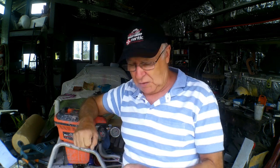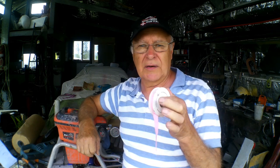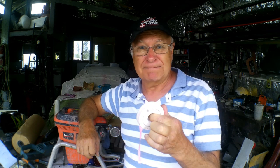The one thing you don't want with an airless spray gun is a leak, with paint spurting out at high pressure all over the place. Ask me how I know this. To avoid that, start with just clean water instead of paint, and that way you can see if there's any joints that need further tightening, or you can seal any loose fittings with plumber's tape.